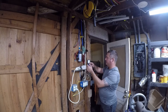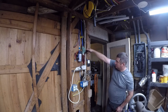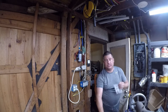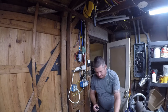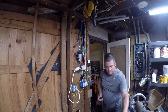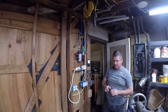You want to be careful not to ruin your power supply wires, but beyond that the rest doesn't matter — and this will probably get messy. There we go. How that could leak through is beyond me, but it's an eight-dollar part at Home Depot with a five-year warranty, which means it's going back. I probably should have just bought the whole valve, but I thought: why replace the whole valve if you can just replace the solenoid?